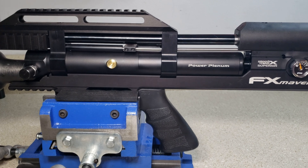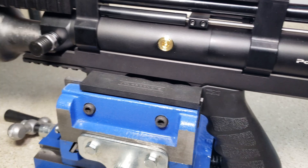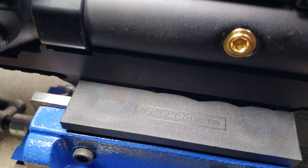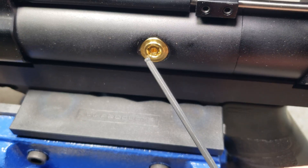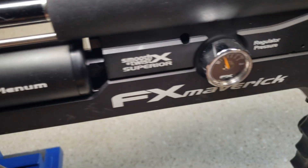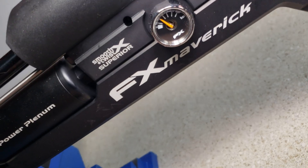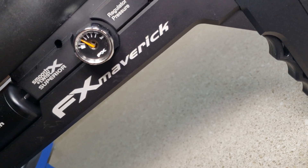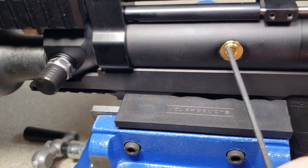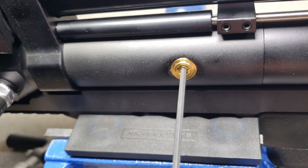It's a 2x1 NBR 90 o-ring, so it's very difficult to replace. I'm going to zoom in here — it's going to get a little bright — so you can see what I mean by it being in there. Right now the regulator pressure is about 100 bar.